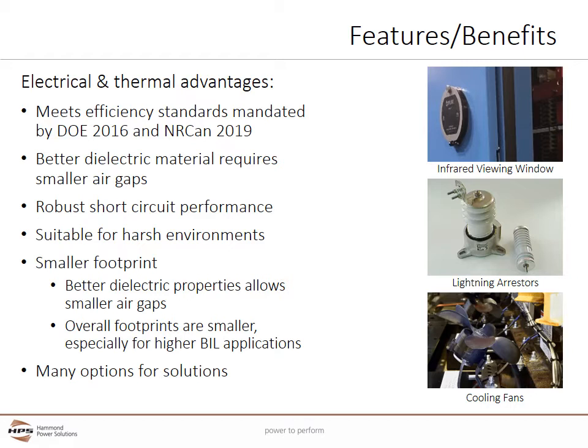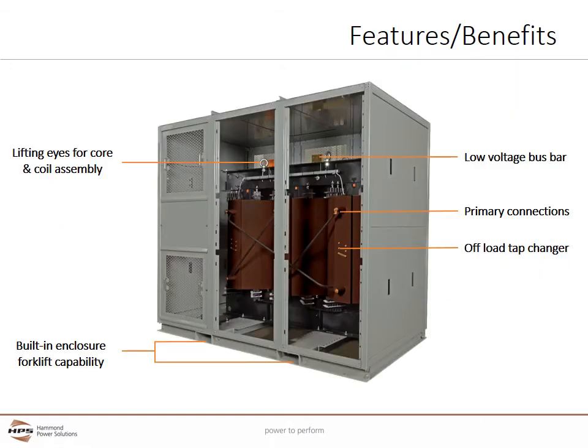Cast coil offers a range of options and accessories available for transformer protection and performance enhancements. The base Endurocoil E design has many features that aid in installation. The base enclosure features built-in forklift slots to allow simple installations without expensive rigging requirements. There are easily accessible lifting eyes on the top of the transformer's core for traditional rigging. The primary and secondary connections are easily accessible, coordinated close-coupled designs for switchgear are readily available, and simple metal links offer easy offload changing of the voltage taps.